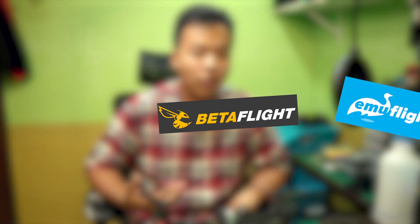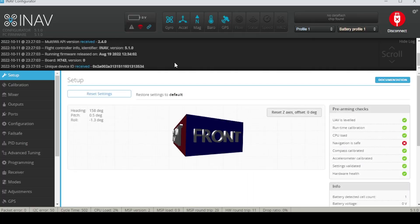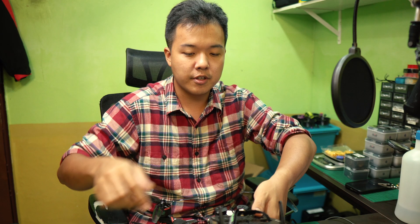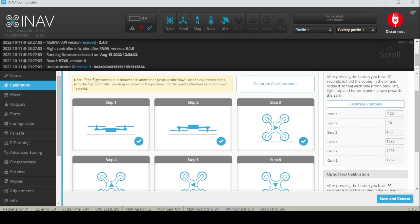Now I'll do a quick rundown on the programming. I've chosen INAV for my cinelifter because I wanted GPS position hold. If you do not intend to have the GPS position hold feature, you could totally go for Betaflight or even EmuFlight, as EmuFlight has some presets for cinelifters. The pre-arming checks — all of these have to be ticked before you're able to arm. For now since I only have USB plugged in, navigation is safest off. When you come in you can straight away calibrate the accelerometer, clicking every time you move position.